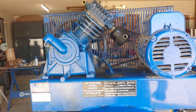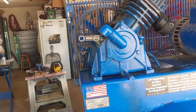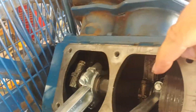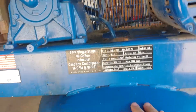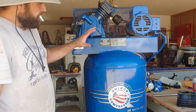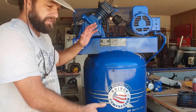This is a fairly large compressor. If you know anything about compressors, you'll recognize 18 CFM at 90 PSI — that's a pretty serious machine. I need this to run air-powered sanders and things like that. So that's how it works. Just a quick review: draw the air in here through the valve plate, the pistons are reciprocating back and forth, the crankshaft is what drives those pistons up and down, and then the compressed air comes out. In this case we have a receiver tank — that's the big tank here — which is just a reservoir to hold the compressed air. It allows the compressor to run for a period of time, compress the air, and then we use the air. As that pressure drops, there's a switch on the side that's going to turn the compressor back on saying that we need more air.